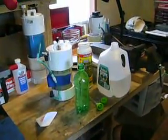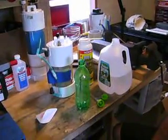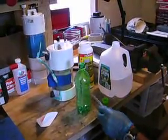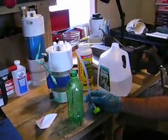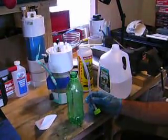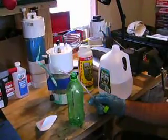As you're monitoring your cell, you need to add electrolyte to keep your current in the desired range that you've set for. I came up with a simple device that is safe and easy to use to refill your cell with electrolyte. It can also be used, if you don't have an auto refill system, to put distilled water in and refill the cell using that.